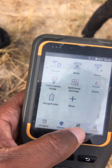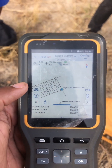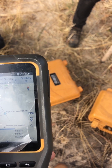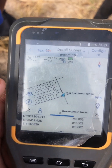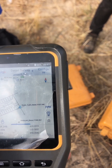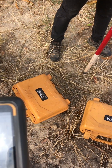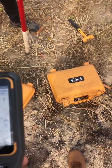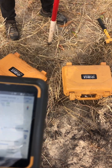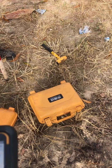Always use it on RTK Fix so you won't have problems — it will have a real-time kinematic fix. Now after setting the base and rover, you go to Survey, then Detailed Survey. We already have a file loaded — this is our AutoCAD file that we want to stake. In some cases you might find that you set your GPS on a non-known point and you want to calibrate it with a known point, so you go to that point.